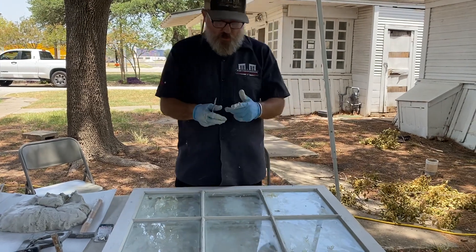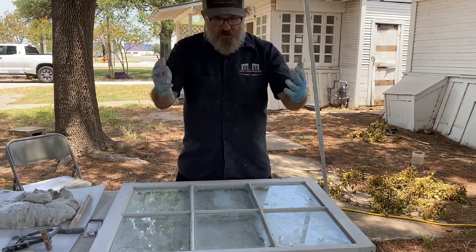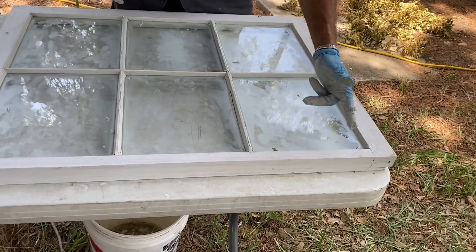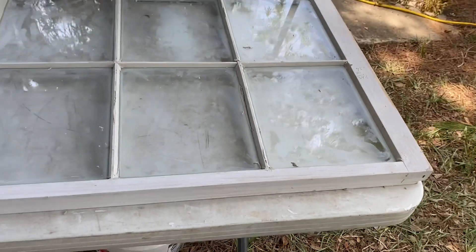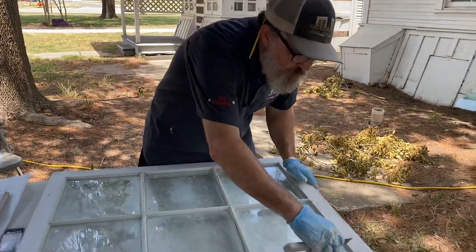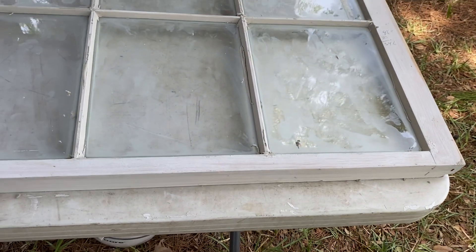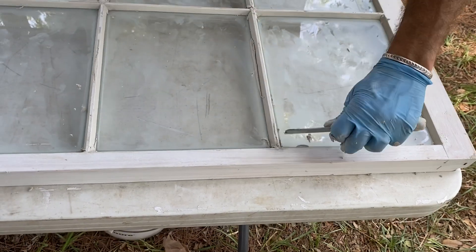What you need to do is finish your glazing by focusing - starting on your corners and working toward the middle. I'm going to start over here and you can watch me feather it to about the middle from one direction, and then feather it through the middle from the other direction. I'm not going to try to go all the way to the end and exit - I'm just going to come in and feather it both ways. Notice how I'm doing it right and left-handed - see how handy that is.